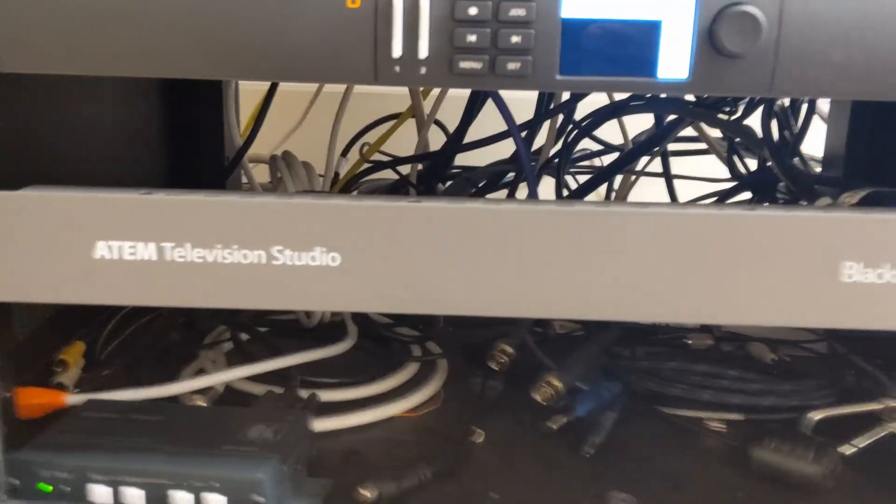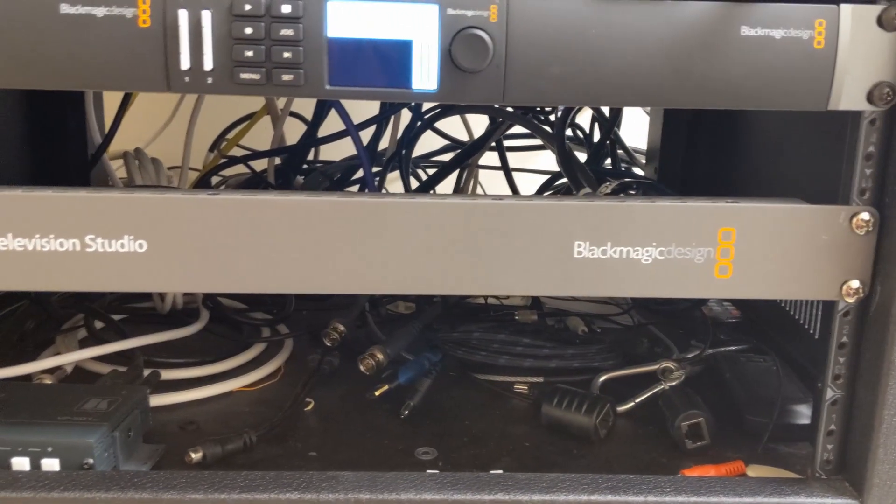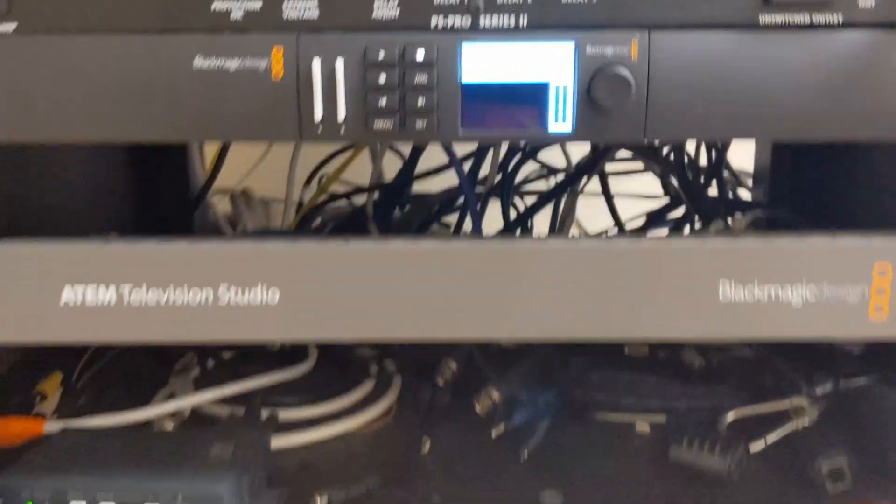So I'm going to put the scaler in place, also because it's doing 1080i — when the pastor's moving around, this fast motion creates visible lines all over the body on screen. I'll splice in a video so you can see that. Hopefully I'm going to be able to convert this back up to 1080p and put it at a frame rate where it'll look fine on the screen.